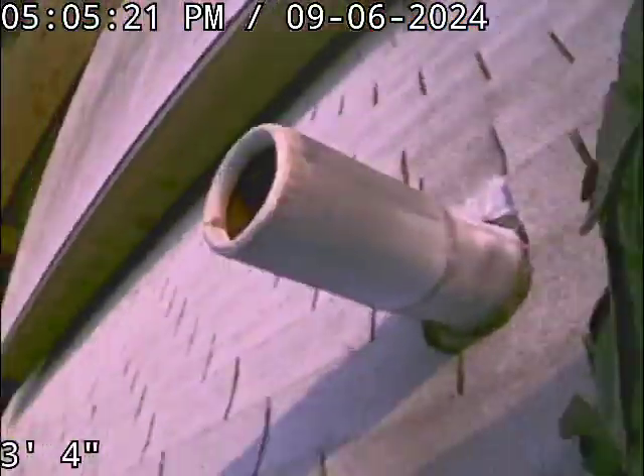Located up on the rooftop, going through a four-inch cast iron main vent that's on the rooftop of this house. Looks like it's had an addition put onto it. We're on the one-level portion of it, the original part of the house, and we're going to check the overall condition and serviceability of the sanitary sewer line. Water is running. We're going to zero out at the base of the vent. Got some cobwebs to clean off the camera here in a second.